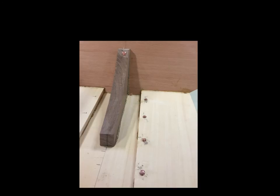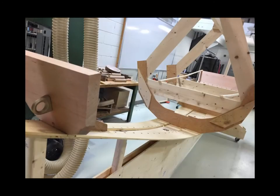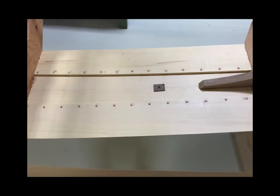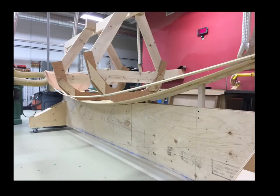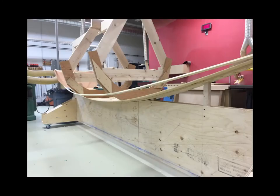Fortunately Leah was able to help, being home for Thanksgiving, and put in all sorts of rivets after that. Then the bow transom went in — small transom — and the knee behind it, creating four stations where the shape of the hull is basically defined. Next I added a batten to establish the shape and allow a bevel to be cut on the plank to accept the next plank. The bevels are in on both sides and the batten was eventually moved up to the next spot.